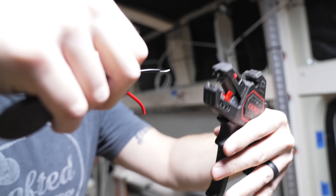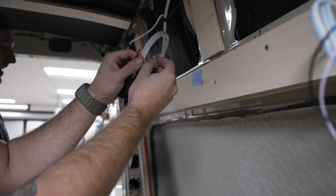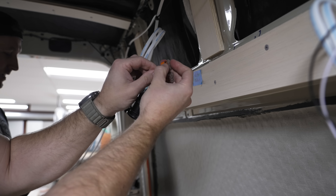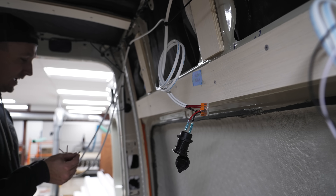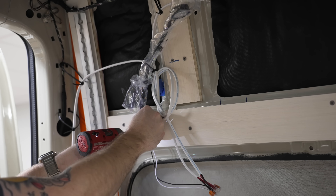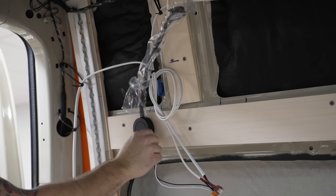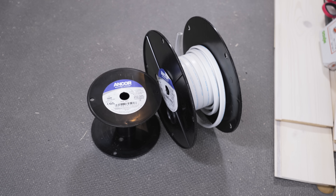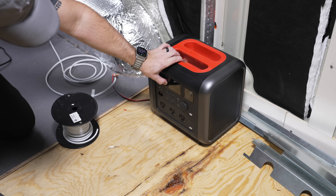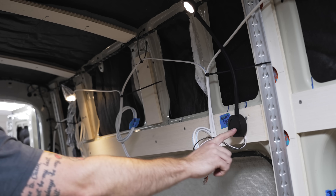This DC wiring couldn't be simpler — we just connected black-to-black and red-to-red and were good to go. We used WAGO connectors for all of our connections, and these make for quick, strong wire connections. I'll link to the specific wire we used in the video description, because you shouldn't use any old wire from the home center for this kind of project. It's really best to use marine-grade wire, which is rated for higher working temperatures. After wiring the circuit, we could add a little DC barrel plug whip so the circuit could run off of the battery bank.